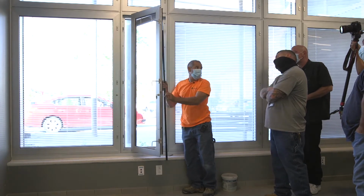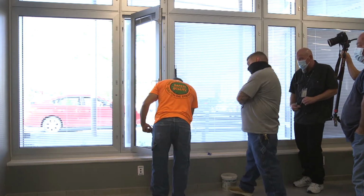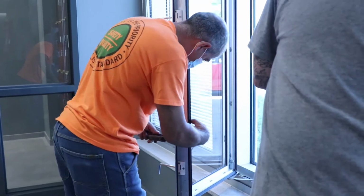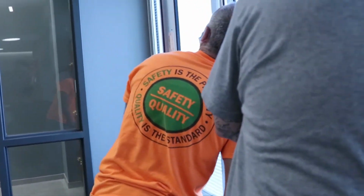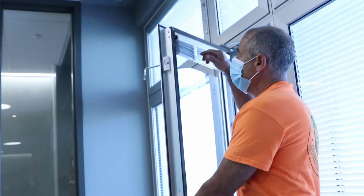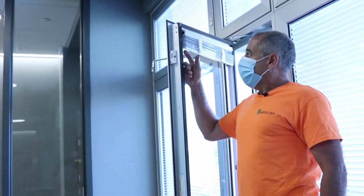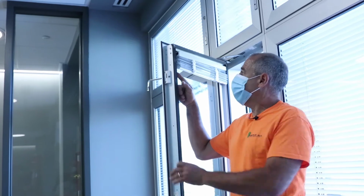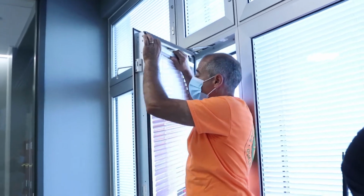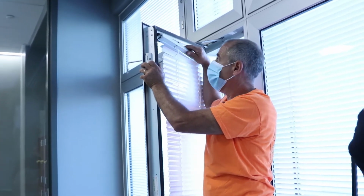If you have no problem with these blinds, the snap trim comes off the inside, and you can see the rail system and how it works. It's basically just a wire up to this that has a barrel nut with one little flat spot on it. To remove this, the blinds just pop down, and you would remove the little clips that are on the side here, Phillips screws, not security screws, on the inside, and you would undo the barrel nut that's there, and that would let this rod free. You pop these down just by pulling on them, and popping the back out. And if this clip was removed, this would come right out.